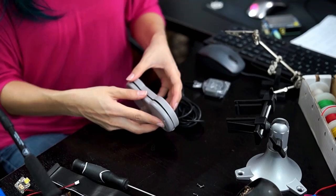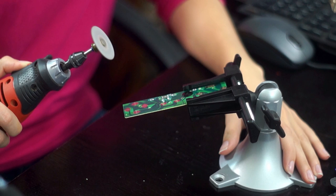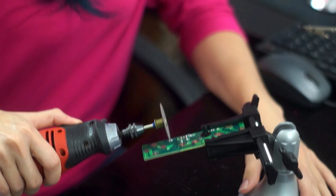If you're going to build one yourself, it's a good idea to skip ahead to the next step and open up the SNES controller that you're taking the buttons from to make sure that they fit. If not, a rotary tool with a round cutting bit will be your best bet. The buttons just drop in, but I had to cut the circuit board from the controller into three parts to make them sit where they needed to be.